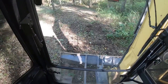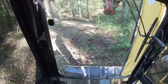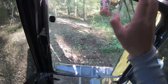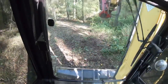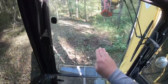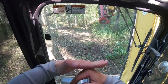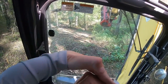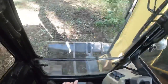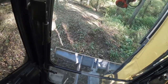See us tipping? Now in general, when you're going down a steep slope that's consistent, if you hit a little bump, this thing will feel like it's just going to tip and just flip over, and it's not. What it's going to do is it's just going to kind of bounce along. Because what happens is when you get to a high spot, your tracks are straight, but you got that high spot, and all you're doing is teetering. You're going up, teetering over, and that's why I say it's best just to idle down and just slowly track along at a steady pace.